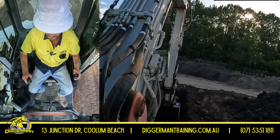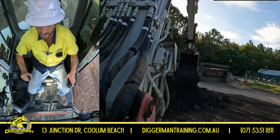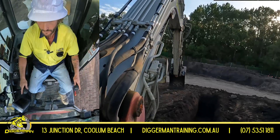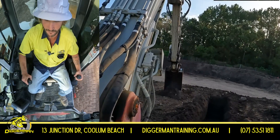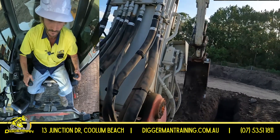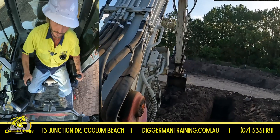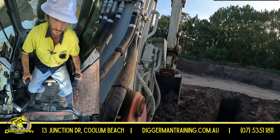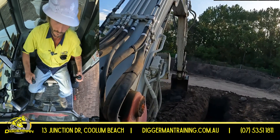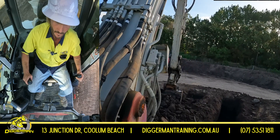For what we're digging, I'm not going to let anyone get into that trench until it's nice and safe, so we're going to do a bench first. Getting a good two bucket widths wide, and as I'm pulling it in towards myself I'm also slewing to the left to keep that same width, going about half the depth of the trench.